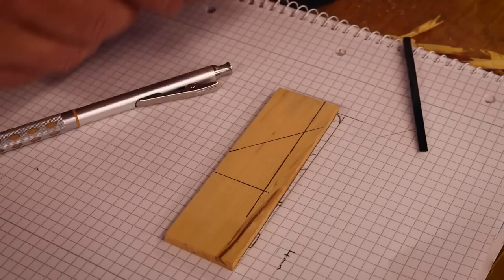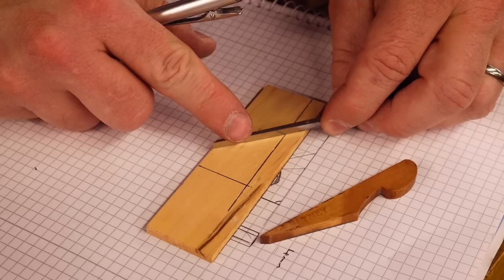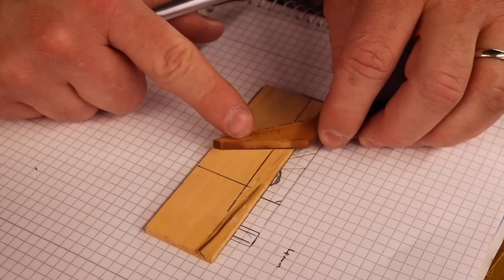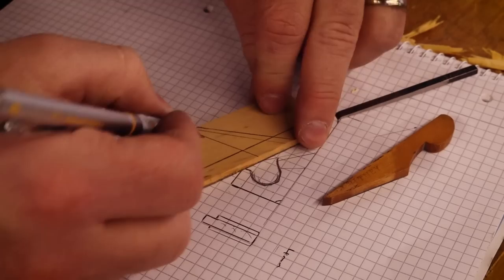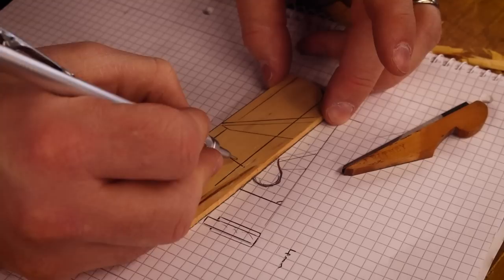This is the wedge that I want to copy, but you mustn't forget that the blade has a wedge shape to it as well. Put your blade in place — I don't want it to go too deep, although obviously it can be changed since it's boxwood — because that's now the angle where I want to cut. It's a combination of these two pieces. I want it to be about that deep.